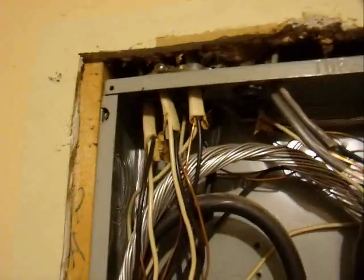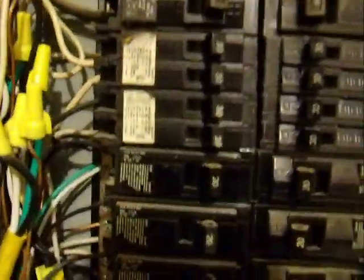There's three wires coming down from the attic. One wire — usually the black one — goes into the breaker. Then a white one will come over and hit this bus bar back here in the back, which is a ground bar. And then the naked copper wire usually hits this bus bar on this side, on the right. But actually they're the same bus bar — they're connected to the same ground wire.